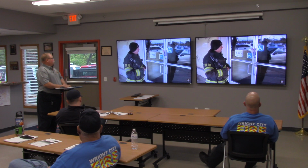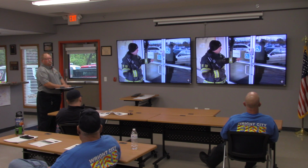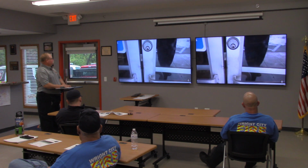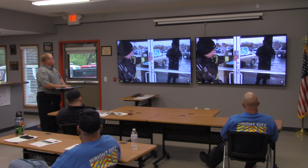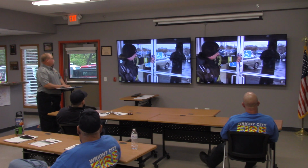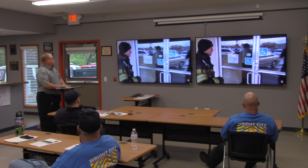Another technique that we have with the circ saw, it's just another option, is we can actually come in here and cut this deadbolt right here with the circ saw blade. One of the things that you've got to be cautious about is if this gap is not big enough, you can make it bigger by inserting a wedge up top or down below.